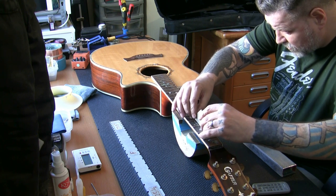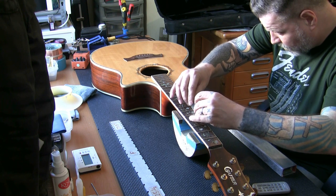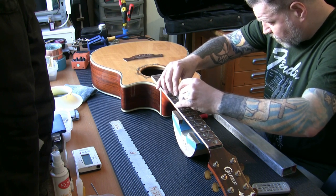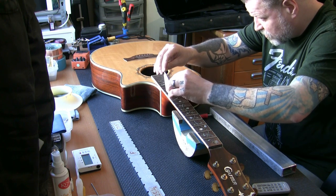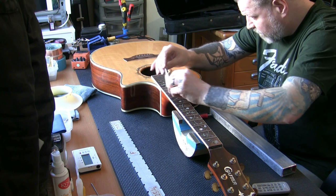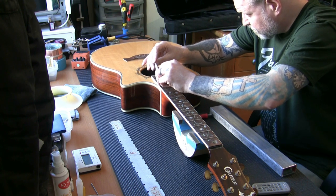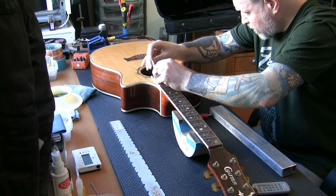I normally do three areas — center, outside, inside. The problem is not high frets across the board, but we do need to re-profile especially the first six or seven frets. High on that edge, high on that edge... so we have frets 3, 4, 5, 6, 7 high, then fret 8 in two places, fret 9 — so nine high frets total. We would have needed to do a fret level anyway.